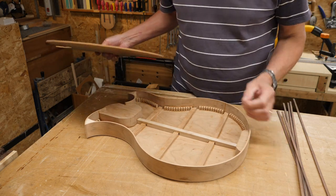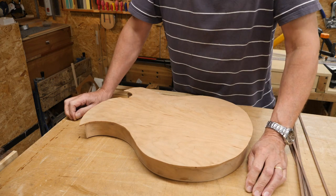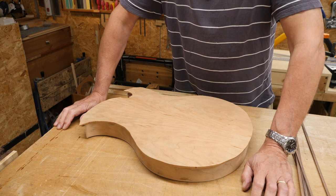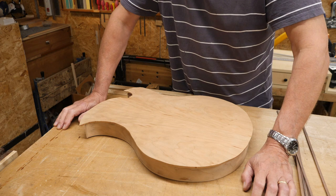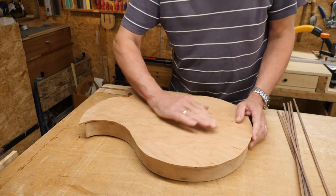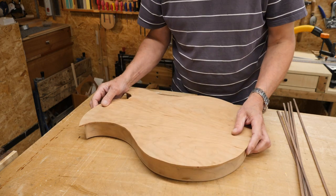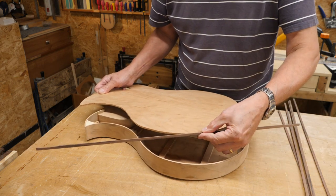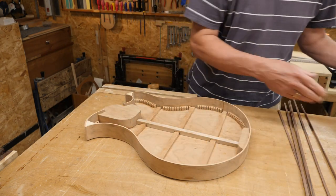I'm not sure how we're going to do this. There are a couple of ways we could tackle it. One is that after I've stuck the top on, I could go around the edge with a special router bit. But the problem is I don't have the special router bit, and because the top has a slight arch it might dig into the sides of the guitar. So the other way is to put the binding on the top before I stick it on the guitar, and to do that I need a special template.